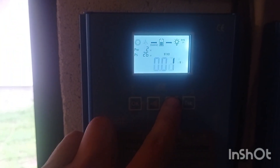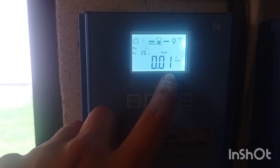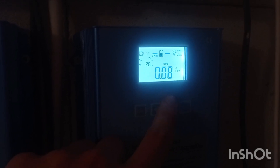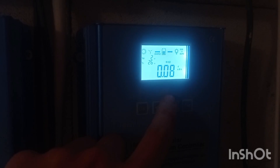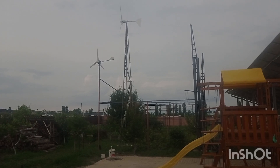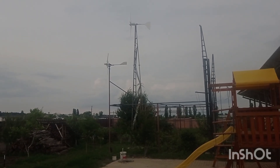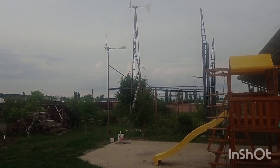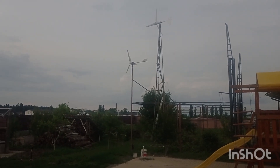This is the first partial day of work — I was stopping and mounting them. Even the S3 was able to generate at least 10 watt-hours, which is not bad since it was only working maybe a couple of hours. The self-made one worked a little longer and today's output is 80 watt-hours — not bad at all given this is not a windy day and realistically only about half a day of work. This week we are expecting winds of 4 to 5 meters per second.